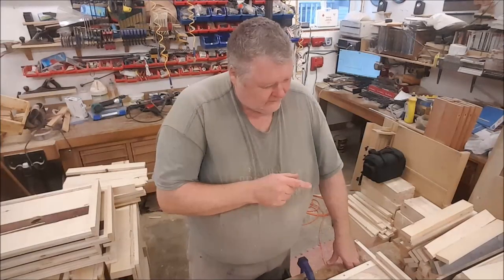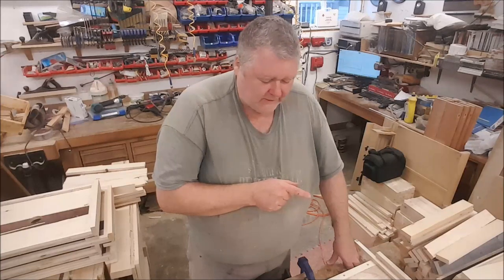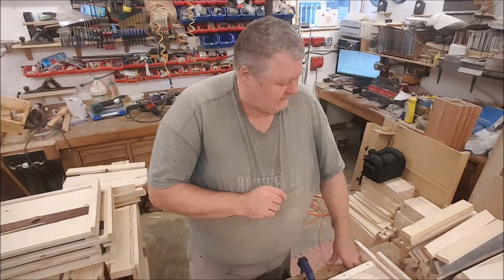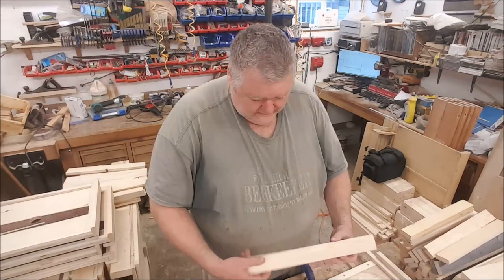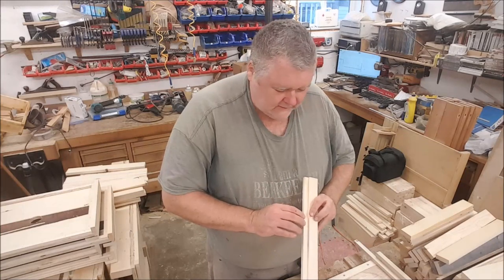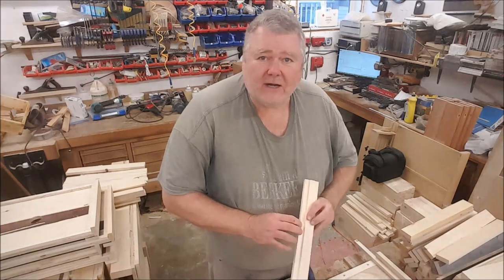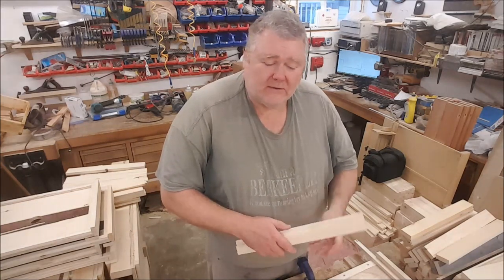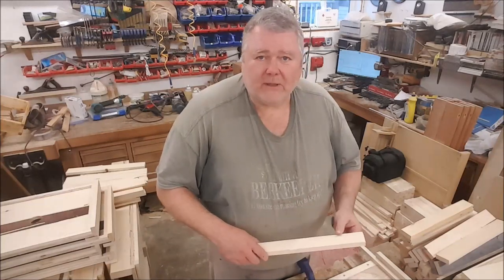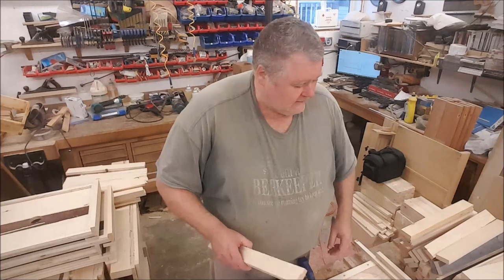So the pallets are out of the way for now, and I'm on the covers. The first 13 covers are going to be a very small challenge beyond the rest. I have to mill some of my parts. This rabbet in these parts needs to be 5/8 rather than 3/4. So those are just going to go through the table saw and cut the overall width of the part down by 1/8 of an inch.